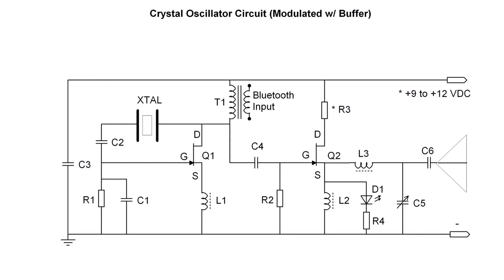The configuration places L2, which I've got at 33 to 47 microhenries, in series with L3, which I'm using an FT50-61 with around 44 turns of 26 AWG magnet wire. So that gives me a total inductance of just north of 200 microhenries.